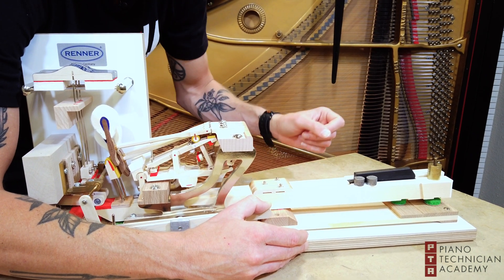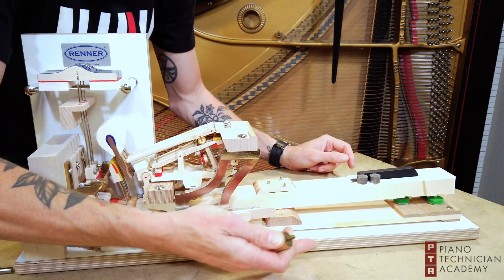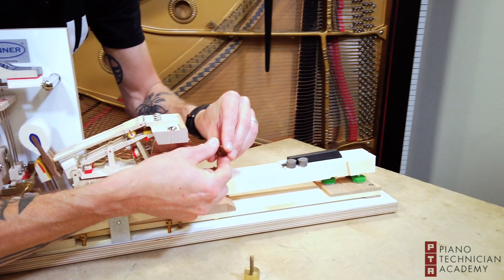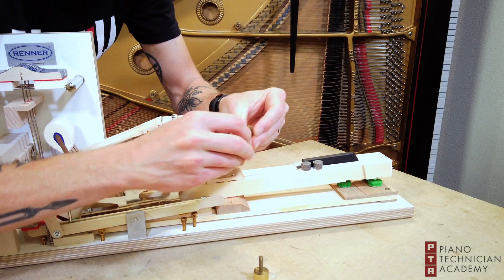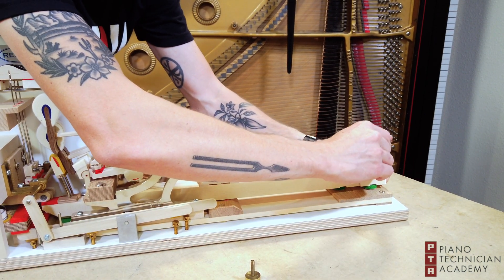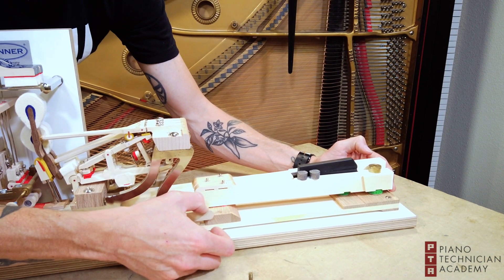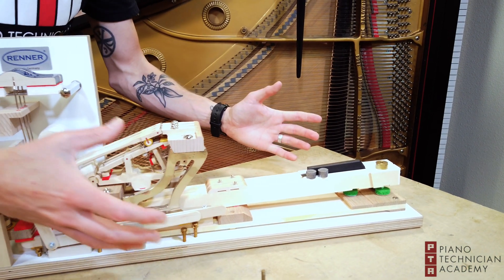The reverse of that is to remove all of these — you want about 20 grams of up weight, which is also a factor. So if I take the 32 off, I've got a 16 and a 4 right here, and I can set these on. Let's drop this key again, put these on, and this should lift up right at 20 grams. I have to do my damper again — I was helping it out. Still perfect.